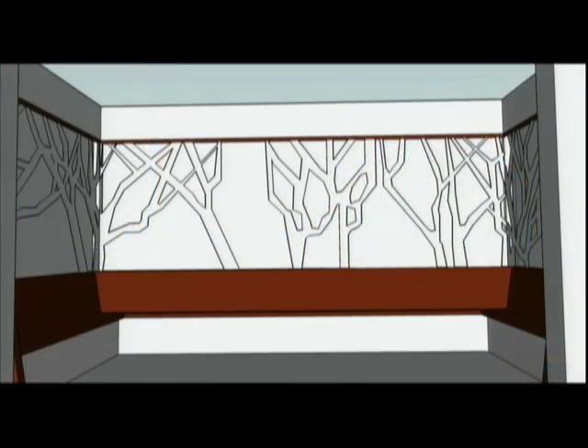I designed a puzzle joint — like a jigsaw puzzle — to break up the trees. There were three walls covered with them, coming to 147 parts total. I threatened to drop them off in a giant box, but instead gave the contractor a numbered key from the SketchUp model. They were nervous about the process, but it turned out to be the easiest part of the whole job — went together like a dream. The puzzle joints are practically invisible; a little sanding and they disappear.